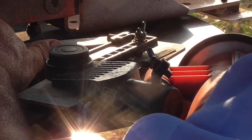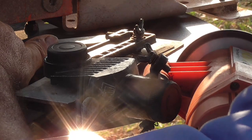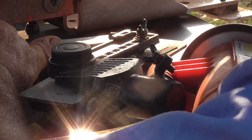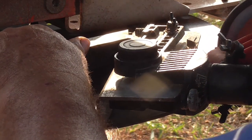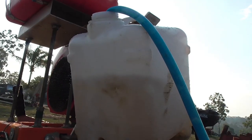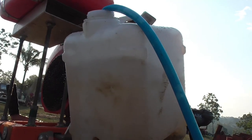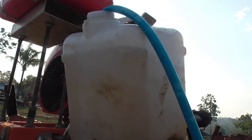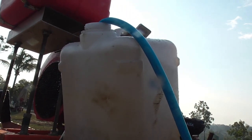Another thing I like to do fairly often is keep the blade sharp. Here I'm just using the sharpener that's supplied with the mill — it's adequate, but that's all. The other thing you have to do, other than put petrol in and check the oil, is fill up the water tank that cools the blade. I run a little bit of soluble oil in mine as well — only a little bit, but I do run a bit in it.